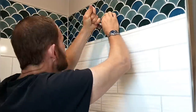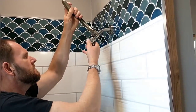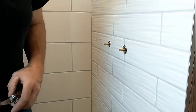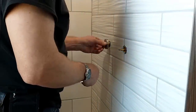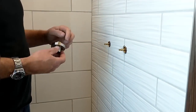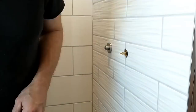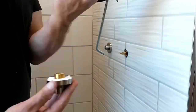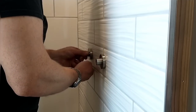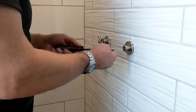I just need to apply some thread tape and pipe dope, screw it in, put the collar over it, and install the shower head. For the faucet, I removed the tape I had on the faucet protrusions to keep mortar off them, did a test fit with the collar to make sure it would fit properly, then applied silicone around the edge so water can't get in behind it. I'll mention the style of faucet we chose: we wanted a two-knob configuration, which is very hard to find these days — the most common is the one-knob universal mixer. We wanted a two-knob style so we can precisely control volume and heat, because we're trying to minimize water usage since we're on solar.